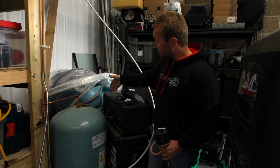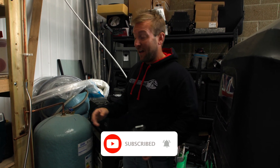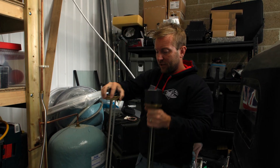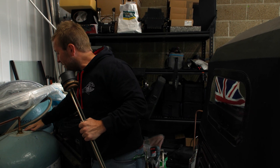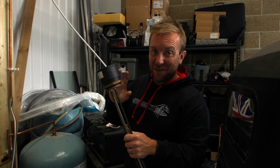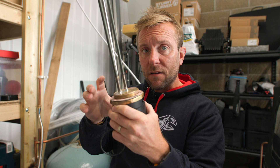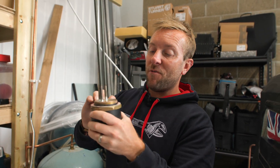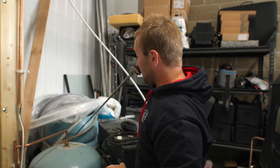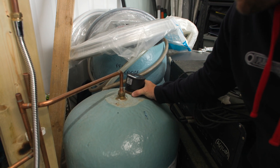This is a vented tank — a beautiful little beast here that I've used for demos on this channel. So we've got a standard immersion heater in here — 27 inch, always just think of a trombone. First thing is there are like three ways that you can seal one of these. Now there is a rubber O-ring on one of these, and if you've got a really nice face on here, the rubber O-ring should really do it on its own, okay? But you can't rely on that — belt and braces is what we want. So we peel the O-ring off, then we pop on our fiber washer with putty on each side. If you want to, you can then pop back on this O-ring, and even if you want to go even further, you can pop a little bit of PTFE on this thread. Then you'd feed this down, grab a set of grips, and you'd actually do that up on there. And that is effectively installed.